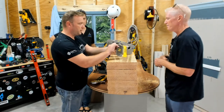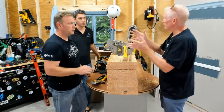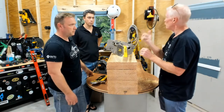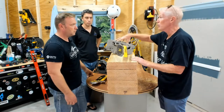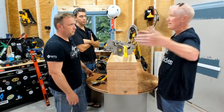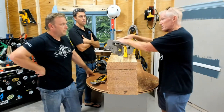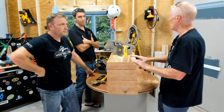This runs at half the RPM of a chainsaw, so with a chainsaw you have to be very precise about tension, but with this you really don't because it's running at a much slower speed. It doesn't get hot like a chainsaw. People ask about an oiler — if you're cross-cutting like this, it works fine. If you're ripping a 20-foot beam, get a can of silicone spray and give it a shot every two or three feet. A lot of guys like not having an oiler system because they're cutting finished wood and don't want oil staining it.